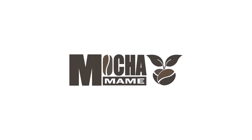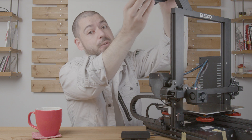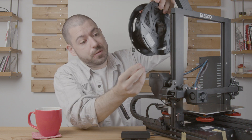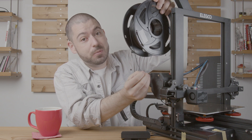Good morning. Do you ever hear a squeaking noise coming from the filament detector? This is caused by filament rubbing against the brass insert. At first you might not hear it, but as you get closer to the center of the spool, the angle of filament is going to get sharper and sharper and cause more problems. In the worst case, you might end up with some under-extrusion.